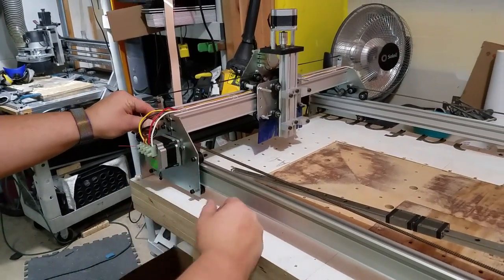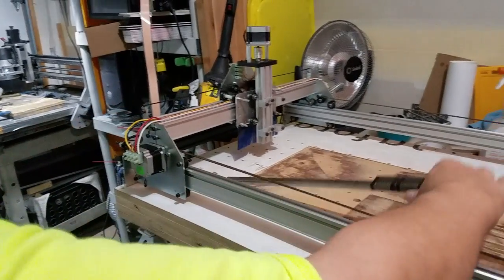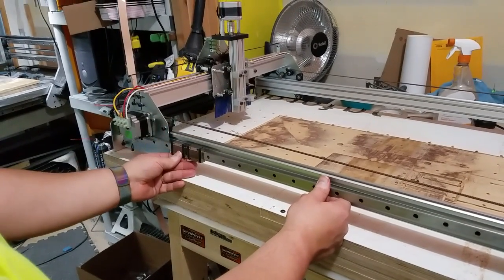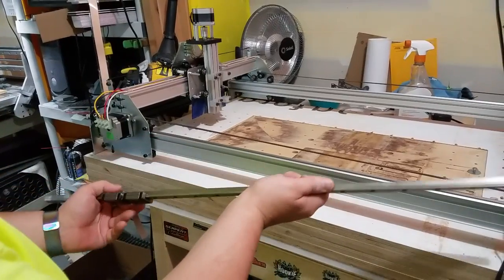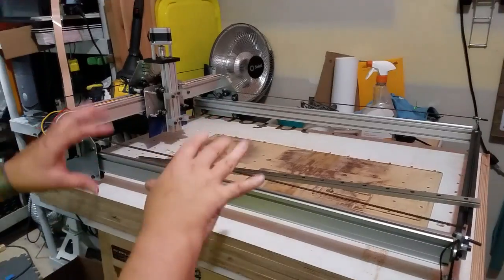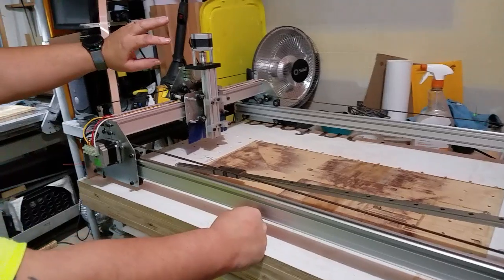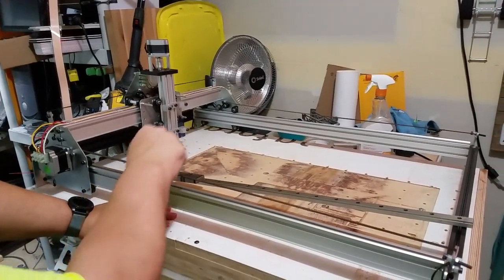It's gonna be simple — I'm just gonna redesign a whole new plate, because the current side plates are only about 0.090" thickness. I'm gonna replace those with quarter-inch 6061 aluminum and have a mount on the inside of the gantry sides. That'll be nice, sturdy, and rigid. Combined with the steel rails and the makerslide, it's gonna be really stiff.